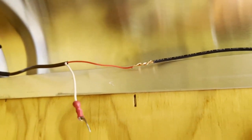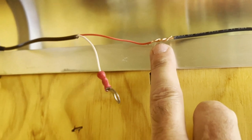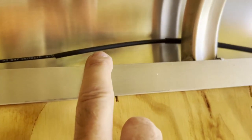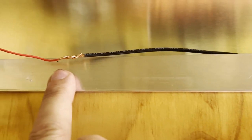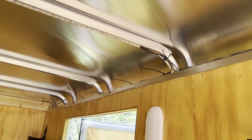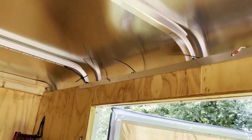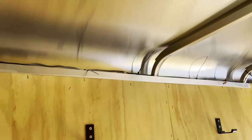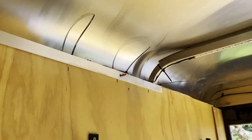The last section of LED tape light — I went ahead and did a through splice, a dead-end splice, and then I'm going to solder that up. I already pre-placed the shrink tube wrapping here to slide over and shrink over the joint when done. All the electrical connections are made to the tape. The last step is just to use some zip ties and tie down the cabling to the existing cabling that was already up there, to keep things nice and neat. I'm going to cut back the tails on these zip ties, and we're all set with the lighting circuit.